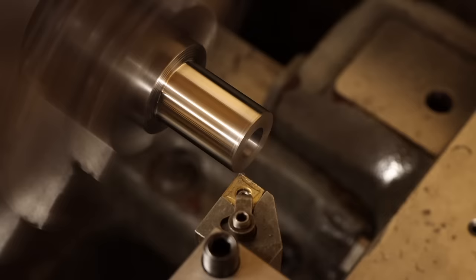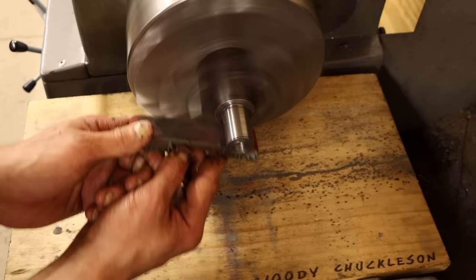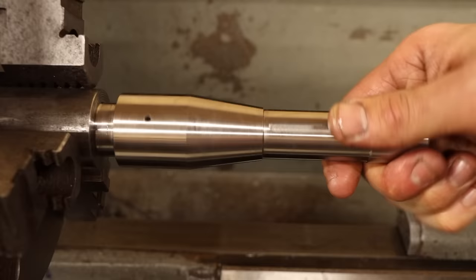But, naturally, that all went to hell on the final 1 thou pass. I just love it when that happens. Fortunately, I was going to emery cloth this surface to bring it in the last couple tenths anyway, making it a buttery smooth fit with the bore of the arbor. Wow, that might actually be one of my closest fitting slip fits to date. This is shaping up nicely.